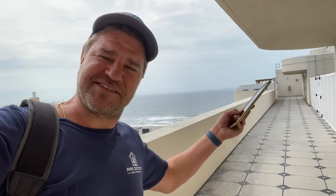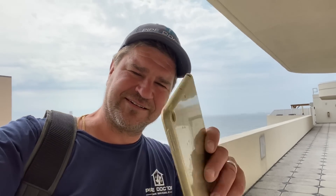It's me Mikey Pipes. Good morning — I am at the Sea of Condensers building over here in Long Beach, Long Island, New York. We got a penthouse apartment with broken AC. I just went to the thermostat, confirmed that we have 24 volts, we have our indoor blower running. Let's go see what's going on outside.